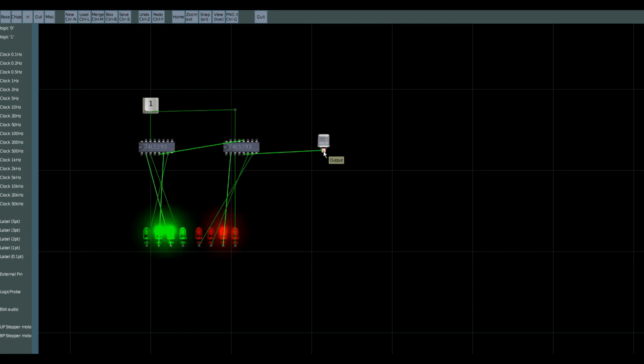I'll do a separate video on how we work out the binary and then the next chip, which will limit us to that 100. We can make it 110, but we're going to do 100. Then we'll set a different lamp that lights every time it hits 100, and the whole system will reset at that point. That is basically where Ben Eater was going with his video, where you get to a certain point and you reset and carry on your horizontal signal or your vertical signal.